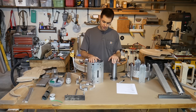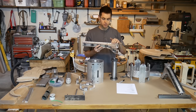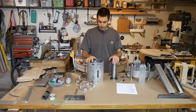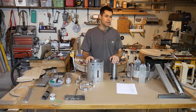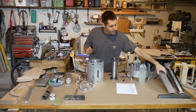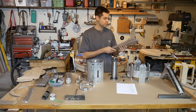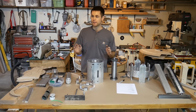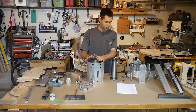I did try using a spool gun on some of the early arms that I welded. And I've got to say that spool gun was very frustrating. I'm not the kind of person who throws things when they get angry, but I came very close with that thing, because you would clean it, prep it, get ready, preheat it, you're welding along, everything is going just fine, and then it stops. It is absolutely infuriating because it piles up and you have to undo it. I think spool guns are good for certain things, but they're not good for stuff like this.